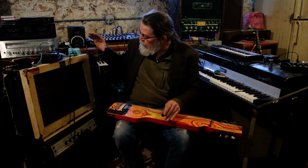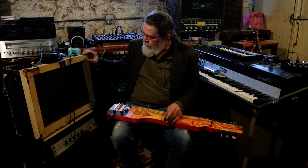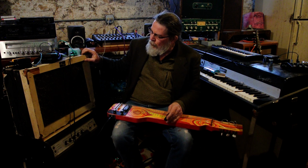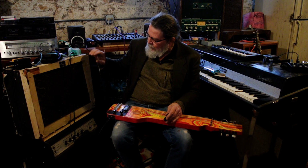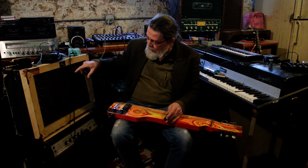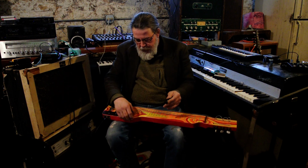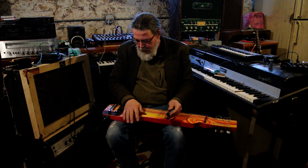We're playing through this old K550. It's actually two amps in one. It has two single-ended 6V6 5-watt amps. One is a dry amp, which then feeds a reverb tank, which then feeds a wet amp. So it's very cool. You can hear that reverb.